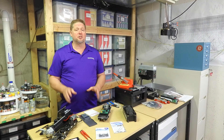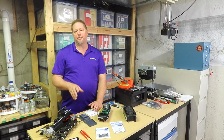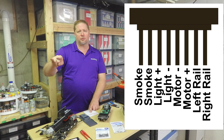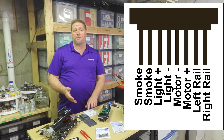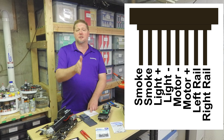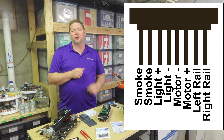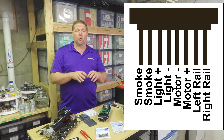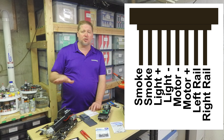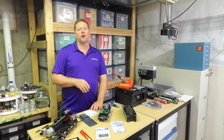It appears these are 12-volt light bulbs, so we can connect them directly to the decoder. On the eight-pin connector: the two outer pins on the right are track power — we can disregard those since we're not using track power. The next two are for the motor, with motor plus and motor minus in the middle of the connector. The next two illuminate the lights, and since all lights are wired together we'll connect those to our light terminals on the decoder. The last two are for the smoke unit, which we're ignoring for now — so we're only using four wires of that eight-wire harness.